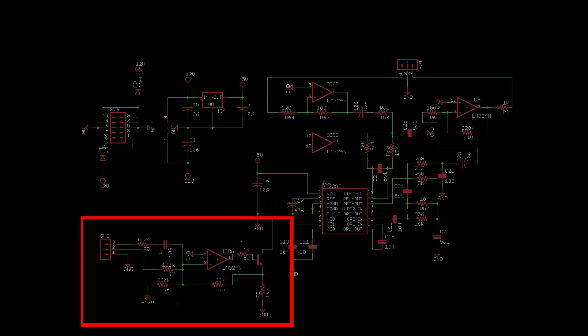The only thing I did differently from the datasheet was to add a voltage controlled current source to the VCO pin. This current source changes the frequency of the on-chip oscillator and thereby the length of the delay. Changing the length of delay over time has the effect of compressing and stretching the sound to a degree, and that's the effect we want. The wow and flutter inputs are connected to jacks through 100k potentiometers mounted to the faceplate so the effect can be limited to the desired amount. The flutter input is also AC coupled.